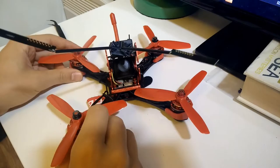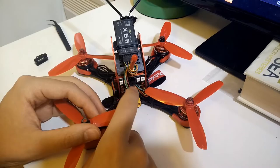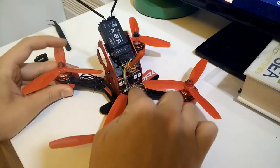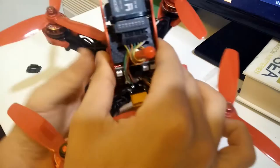After a lot of faffing about I've finally settled on the best option for the receiver. It's plugged in at the back and we're using one wire per channel because I can't seem to get S-Bus working on this, so for now I'm doing it one wire per channel using the X8R receiver. I've mounted it on top with a little zip tie because the blades cut so close to the sides I can't put it anywhere else — not here, the back, the sides, or the front. Putting it on the bottom risked damage when landing or from battery impact, so the top seemed like a good idea.